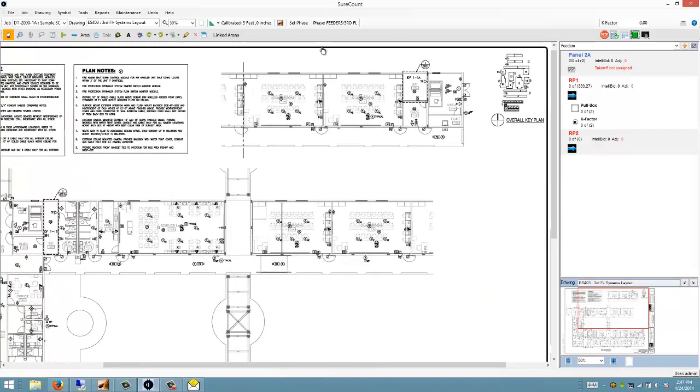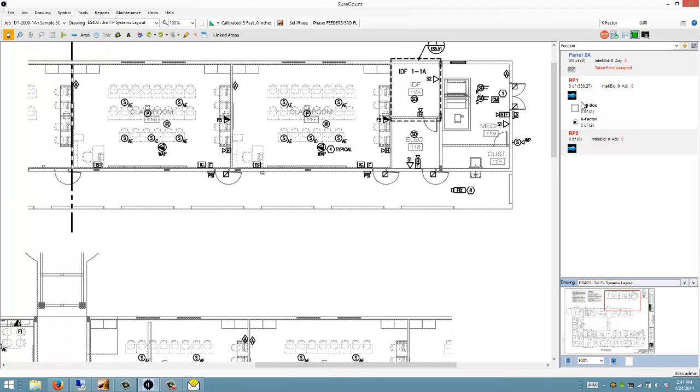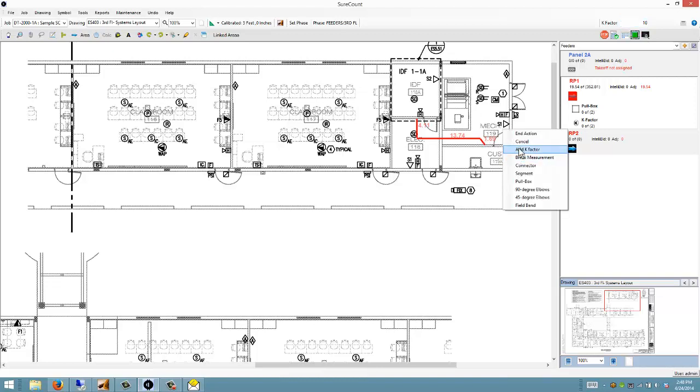Now I'm going to pick up and zoom in on this right to the corner and pick up that feeder, select it, and then pick it up from the riser location out of the electrical room, or up and over and across into this mechanical room, that is. Maybe kick over where this panel board is located, and then add a K-factor on this floor, maybe add 10 feet to drop down from the top of the conduit down to the panel board, and now have just under 30 feet on this floor, as well as a running total of 362.81 feet for the entire feeder.